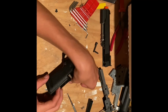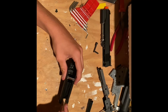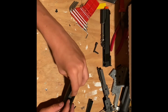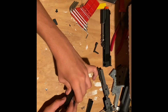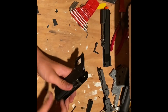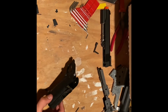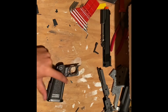When you install the leaf spring, there is a groove, sort of a little channel in the frame right here, which lines up with the bottom of the leaf spring. So when you slide that in, you can push the bottom flap sort of into that channel, and that goes in nicely. The main spring housing slides right back in. Where's the pin? Pop that back in there.